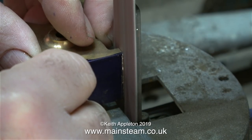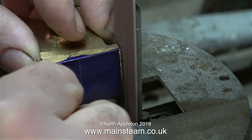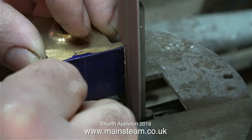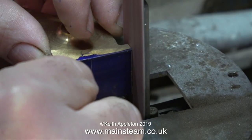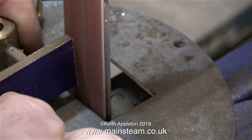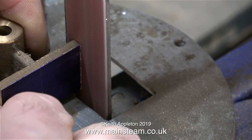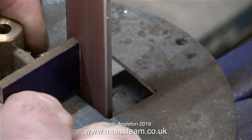The main reason for not wanting to go anywhere near the line is because I'm now using my 1 inch belt sander to trim the part to the line itself. With a bit of care and practice, using a 1 inch belt sander like this you can get great results and accurate results. Not only does the part end up being the correct shape, it's also got a good finish.